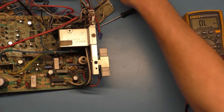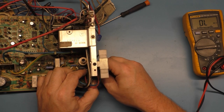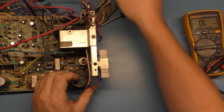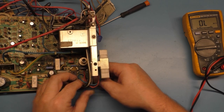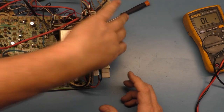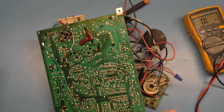That might be the quickest and easiest voltage regulator replacement I ever did. That went right in there. Original insulator is still good, didn't even shift on me. Plenty of thermal compound in there. No need to replace it, they don't get that hot. Well, I said earlier these run hotter than the standard resets, but not the regulator. Talking about the other onboard components here. So let us solder that puppy in and get ready to test this here.